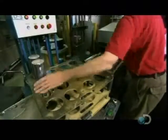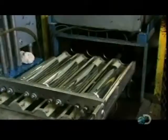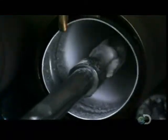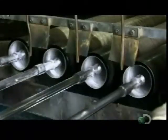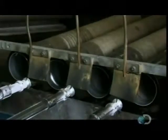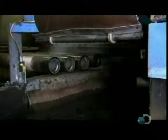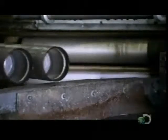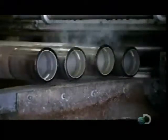The canisters are loaded onto a rotary table that heats them up to 580 degrees and spins them past sprayers that coat the insides of the canisters with a plastic coating. Once it's baked on, the coating protects the canisters from rusting and prevents contaminants in the aluminum from leaching into the drinking water. After passing through an oven, the canisters shoot out into a quenching bath to cool off. This cures the plastic coating, guaranteeing the drinking water never comes in contact with the aluminum surface of the canister.